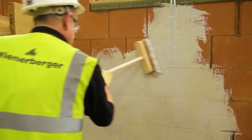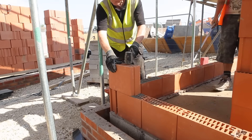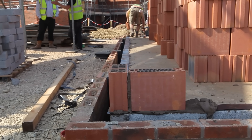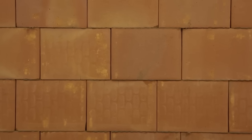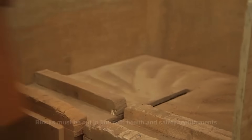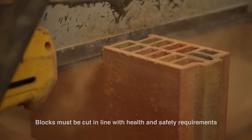The best way to deal with that is to build off an internal slab that has a membrane in it, so the whole thing is protected from any damp, and then you can build straight off the slab without needing a DPC. You're only using these on the internal skin, by the way — not the external skin unless you're doing something like a cladding. I wouldn't necessarily recommend them for external skins with a render, but I stand to be corrected if you've done it and had success.